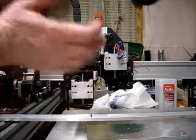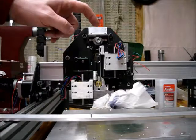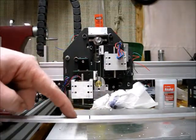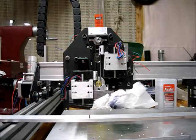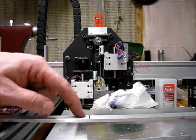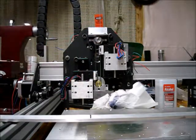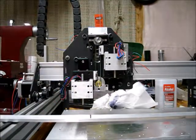By sheer luck from here to here is five inches — didn't plan it, it just worked out that way. Then I've got to drill two holes through this plate and two holes into the end of this piece, which will be really fun. Also I'll probably transfer this hole to this plate so I don't have to guess. Transferring a hole will be the ideal method, so I'll put a flathead screw through here to bolt it in. And then I need to make the two clamps to actually hold the camera to this plate.